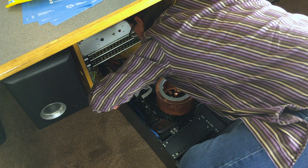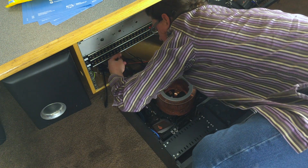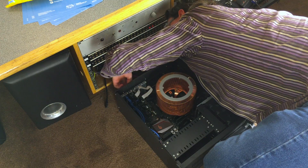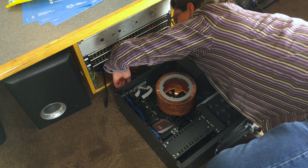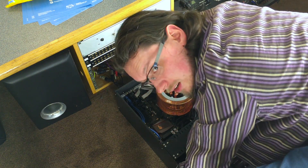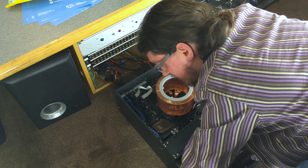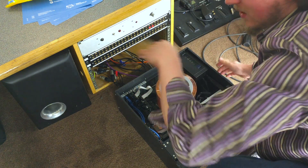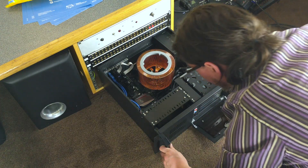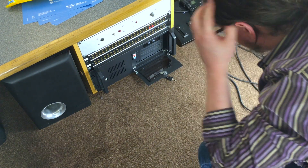This MIDI cable should go in the correct way around. And this breakout — which is for all the digital sundries, the AES and S/PDIF — that can go in there. They may sound unnecessary, but AES and S/PDIF are two channels each. Say I end up with something like a Focusrite ISA1, which is a nice preamp with a digital output — I can just send that directly in here without jumping through other digital converters, which can save a lot of hassle. So technically I can make this 36 in and out.